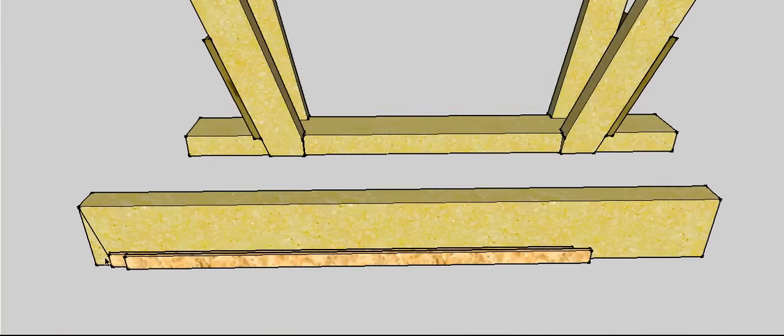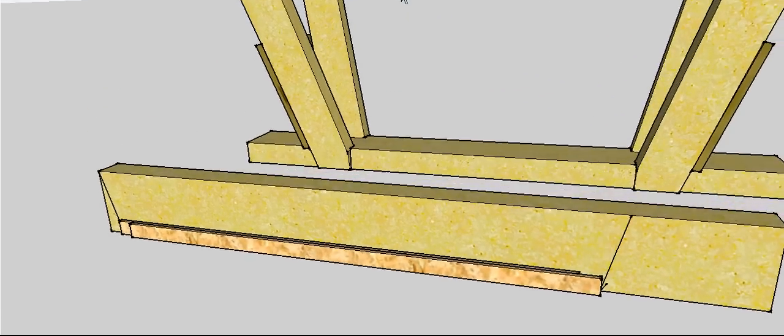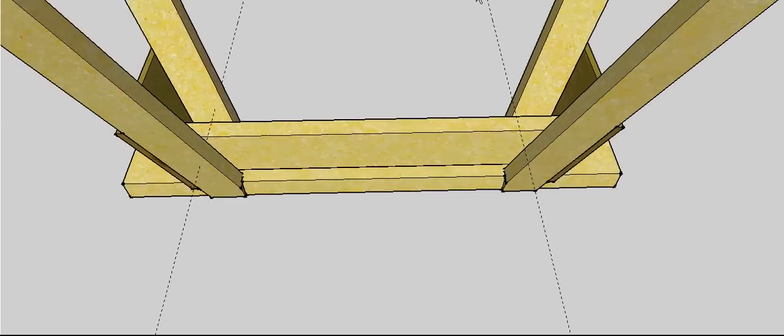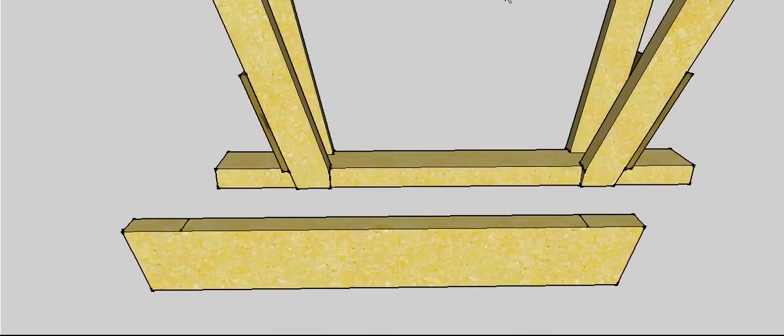And then you can bring them out to the actual spreader and transfer that length off. It's a lot more accurate than trying to measure internals with a ruler or a tape measure. And mark that out with the sliding bevel so you get the angle on both ends and cut to length. You can then drop that back into position, and what I do is I lay a ruler or some sort of straight edge against the legs, and where it hits the legs just put a mark there, and the same on the other end, and that gives me a point to start my curve.